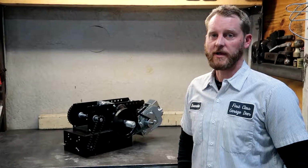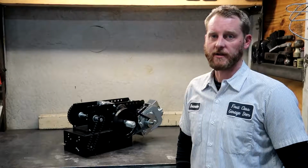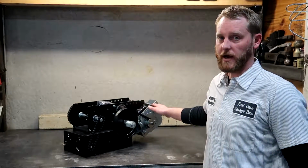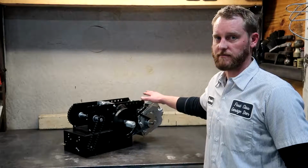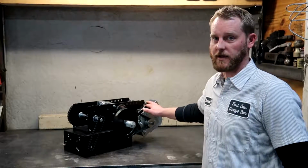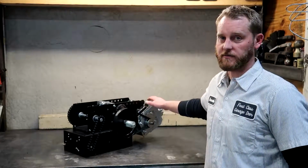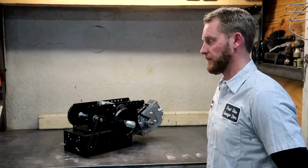Today we're going to be talking about Liftmaster's Logic 5 Elite Series model APT, which is a high traffic trolley operator designed for apartment buildings. So this unit comes standard, half horsepower with solenoid brake in a single phase 115/230 volt configuration. There's no options. So if you don't have single phase, if you have three-phase power, this isn't going to be the operator for you, unless you want to run single phase out, then you can. If your door is bigger than what Liftmaster recommends for their half horsepower motor, unfortunately you're not going to be able to use the APT.